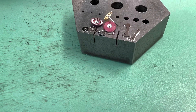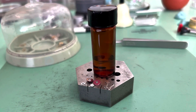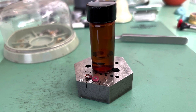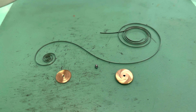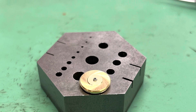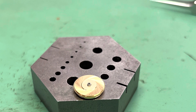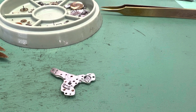The next thing we prepare are the parts that we will be coating with epilam. After that we assemble the barrel. Once that's assembled, I like to install the crown wheel onto the gear train bridge.